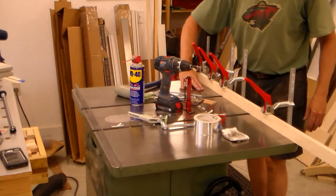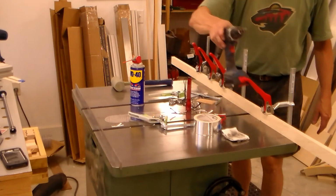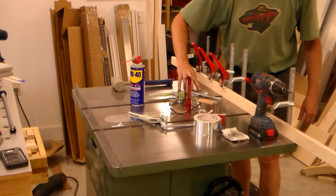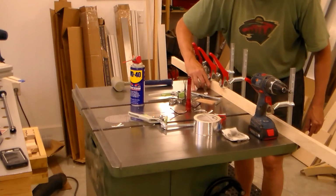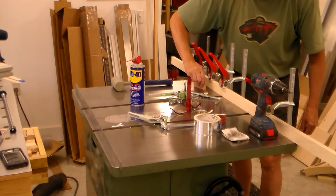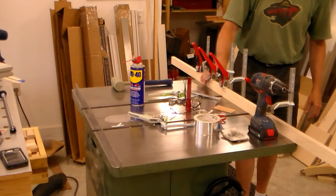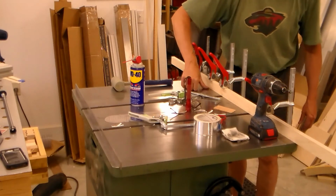Okay, an update on this wing. It's flush right here. I've got a little bit of a low spot right here on the wing. It's a little low, and then it's flush again back here. So flush, just a tad low, flush, and then out here, I'm a little bit high. Flush. Just a little nick right there. What happened, and that's why I got this clamped like this, is I tightened this bolt and it wanted to roll up and come up even higher than it is now.